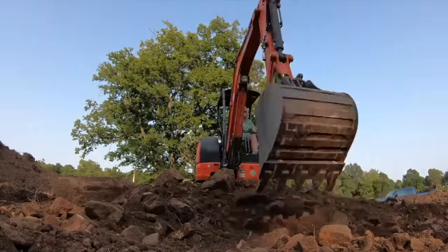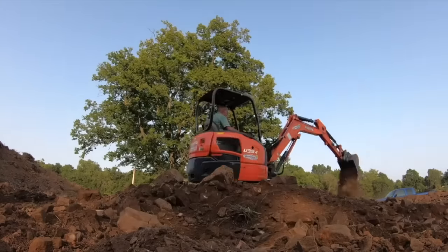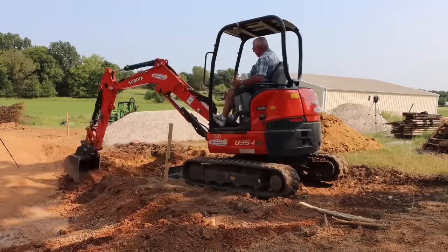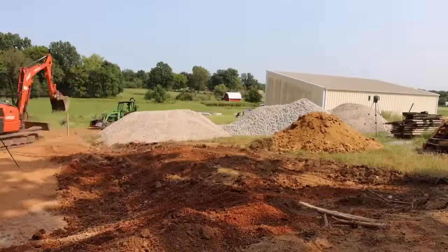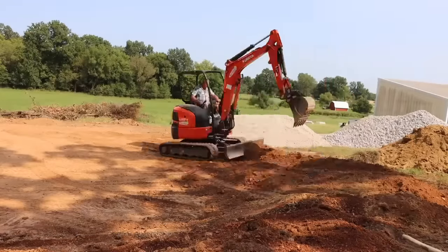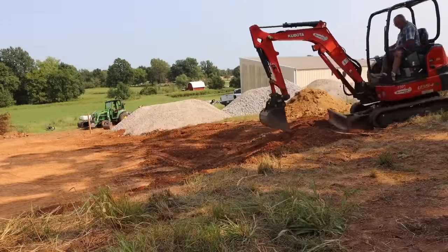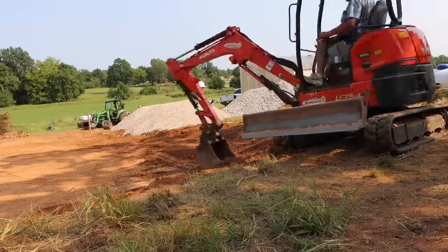After peeling off all the topsoil, we hit a rock layer, and that rock layer I used as fill. Then after the rock layer, we hit good shale, which worked great for grading out the rest of the pad. All things considered, we spent 3 days prepping this area and getting it ready for the building. On day three, we started with building the slopes, and we got a nice graded slope, but I later decided it wasn't gradual enough because we were shedding too much water into the building.